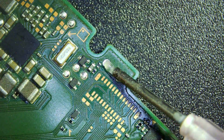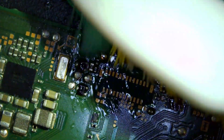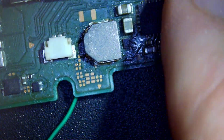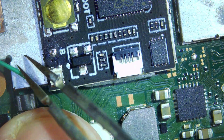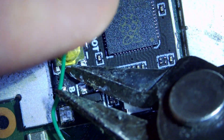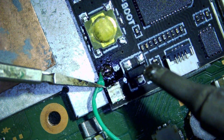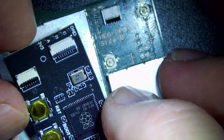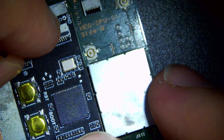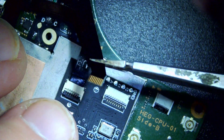Back to the board — we need to solder a point on the back, using the same bit of wire. Clean it, flip the board back over, wrap it round, and go to the B points on the board itself. Do another quick clean, then stick a little bit of double-sided tape on the back of the chip to hold it in place so it doesn't move. Position it just at the edge of the heat shield so it won't get in the way of the heat clamp. Then put the two ribbon cables in, slide them both in, and put the little tabs across.